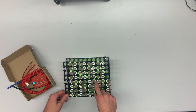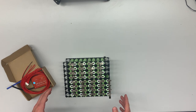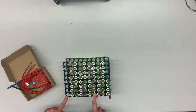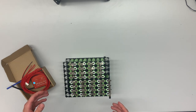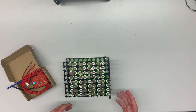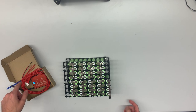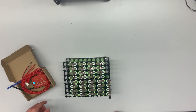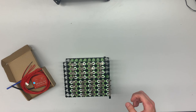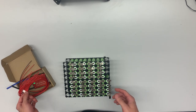So if we then just continue on charging and discharging without balancing, we can overstrain this stage and overall lose capacity, because the voltage will drop sooner and these cells won't get charged to the full voltage, because we actually charge other cells to 4.3 volts, because we can only control current and max voltage without a BMS. The BMS measures every stage and its voltage and then slightly charges those stages more that lack a bit of charge, and so on. So we have to wire